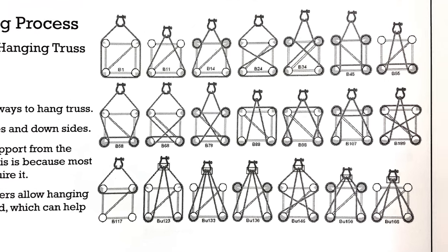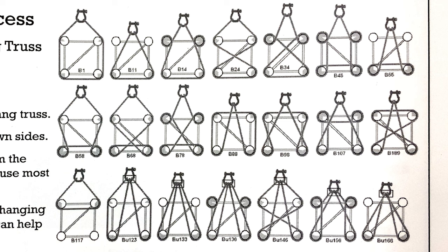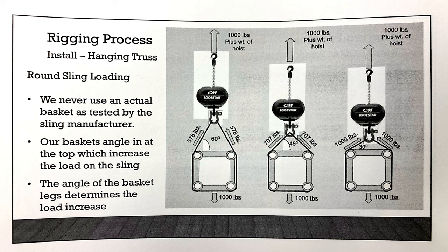Here's a chart of common methods for attaching your span set to your truss. If you look closely at any of these, all of them show the shackle with the bell down and the pin up — because the two points of the span set connect to the bell, it must be this way. Alternate diagrams for attaching truss to a chain motor also show bell down, pin up. Looking at the vendor's rigging, it appears their setup was closer to the third image, which has too shallow an angle on the span sets. As that angle gets shallower, instead of spreading the load between the two legs, each leg ends up carrying the full load — and it gets even worse below 30 degrees.